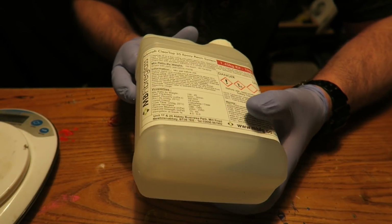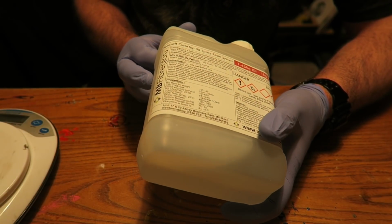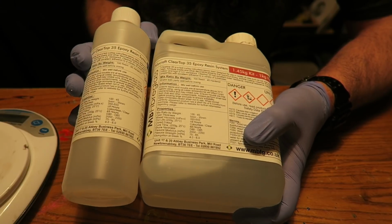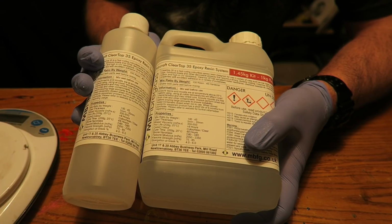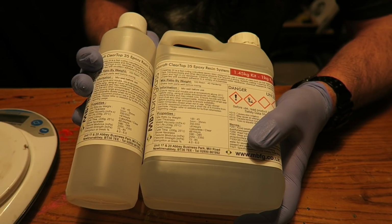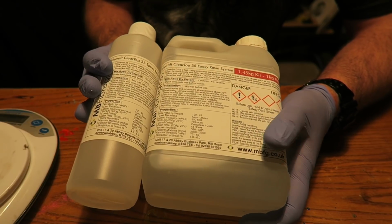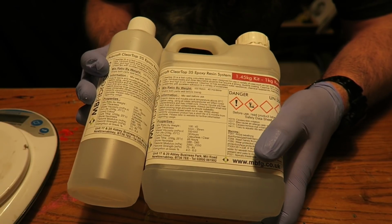We're using a different resin today. Last time we used Clear Top 5, and today we're using Clear Top 35. It's another epoxy resin, but with this one you can cast it in layers up to 35mm, not just 5mm, which makes it more suitable for casting larger items, especially in a pressure pot, and it should work well. Well, that's the theory. We'll try it. This is another MBFG product, and I'll put all the links to it in the description so you'll know what I'm using.